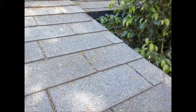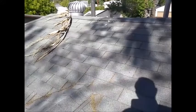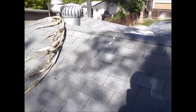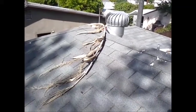And from the garage we found that there's a plywood diaphragm, so that's what we like to see since the '94 earthquake. And they did get a building permit for the roof, and it was replaced in 1995. So you've got a 19-year roof, and this looks actually newer.